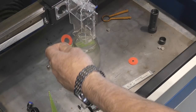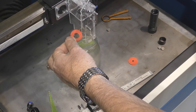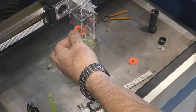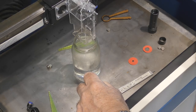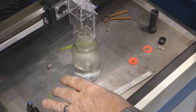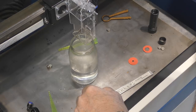The answer is quite simple: if I'm running a long cut, even though the energy isn't staying in one place, the energy is full bore on top of the lens, so technically we've got a 12.7 millimeter diameter beam on top of the lens before it starts to focus down. If you've got a 40 watt tube, the same test might give you an 8 millimeter total diameter even if it's claimed to be a 3 millimeter beam — you'll have to find out for yourself.